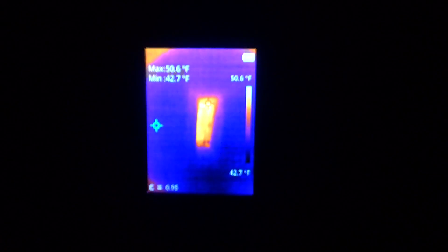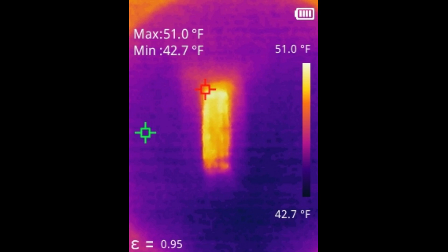We'll go ahead and go in a little deeper. There is enough temperature variation on the walls and the tunnel ahead that I can actually walk right down the middle of the tunnel and not bump into the walls without any light. This is much better than a traditional night vision goggle or camera, which still needs some ambient light to work. The thermal camera doesn't need any visible light at all — it just needs slight temperature variations. One thing to note: when you go from a very warm to a very cold environment, the camera body puts off a little infrared radiation — you can see that as a warmer ring at the corners of the image. It's a common issue for any thermal device picking up surrounding radiation from the device itself or nearby warm objects.